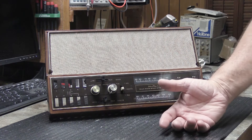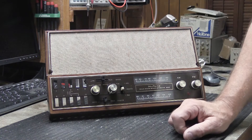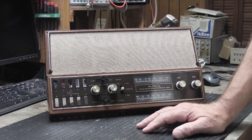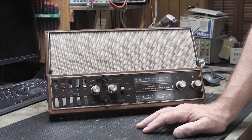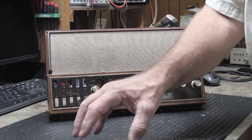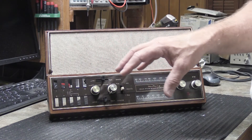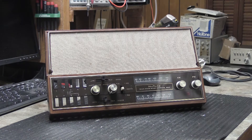You don't want that — it's annoying and bothersome. You just had your intercom system repaired, you paid extra to have the audio jack, you plug something in, and then you have this background hum. Normally you can't hear the hum while the music is playing because the music is much louder, but you know it's there, and for some people that bothers them a lot. It's not going to cause damage to the source equipment or the intercom system — it's just a bothersome byproduct of two different devices being hooked together.